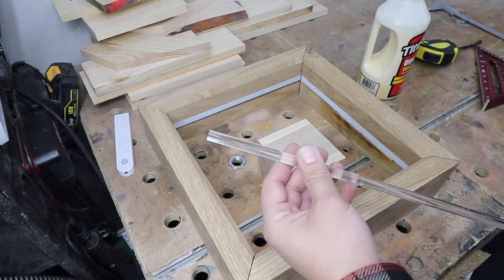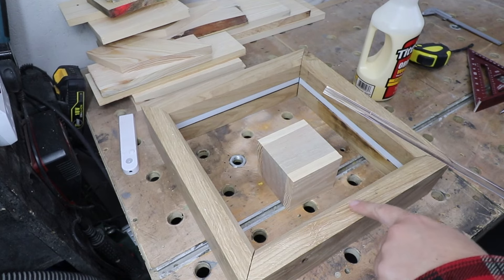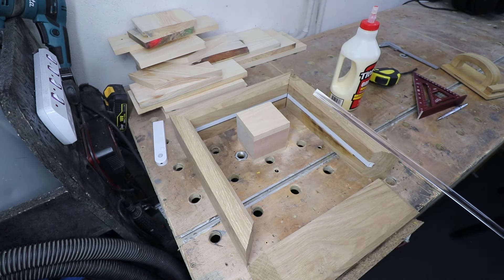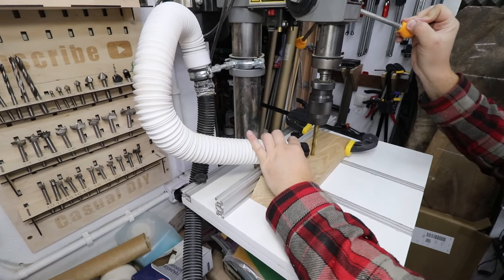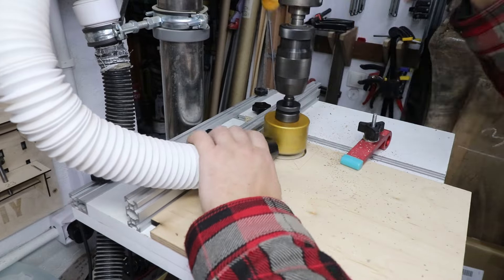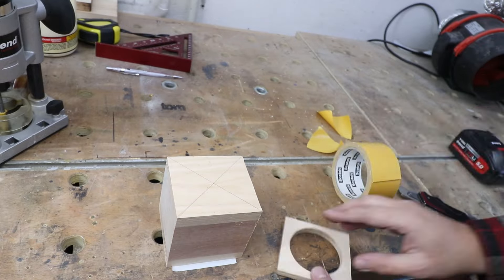I do have this acrylic rod — the diameter is one centimeter, so it should be fairly stable and shouldn't wobble too much. I want to cut it to the right size, pre-drill a hole in the block and in the base, and just glue it in place. Probably CA glue will be just enough. I'll mark up the middle of that and the middle of the base and head over to the pillar drill. On the other side of the block we need to create a hole to accommodate our flower pot, so I'm going to create a hole template that I will stick onto the block and then use my router to remove the material from the inside.